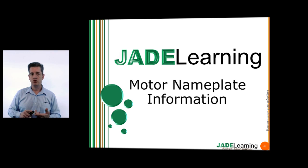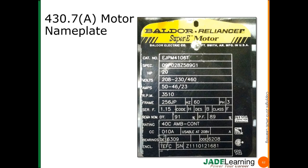If you're dealing with motors — troubleshooting, repairing, replacing, installing new — we have to know what the values on the motor nameplate represent. Every motor should have a nameplate. If your motor does not have a nameplate, or if the values on it are burnt because of overheating, it's probably time to replace the motor. Not all of the values on this motor nameplate are code required to be there. Some of them are optional markings that we would use in order to select the correct motor for our application.